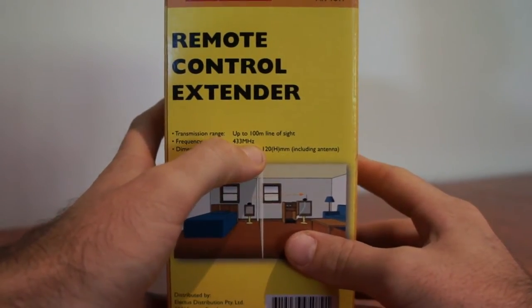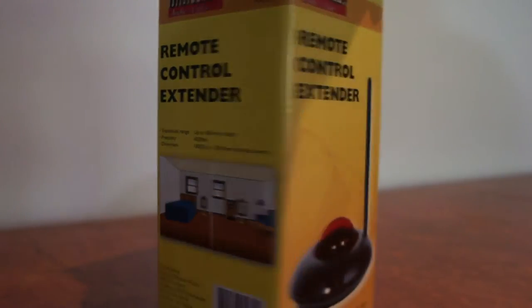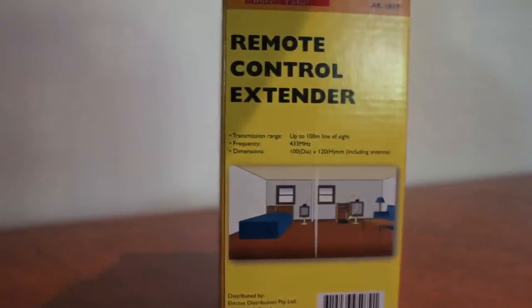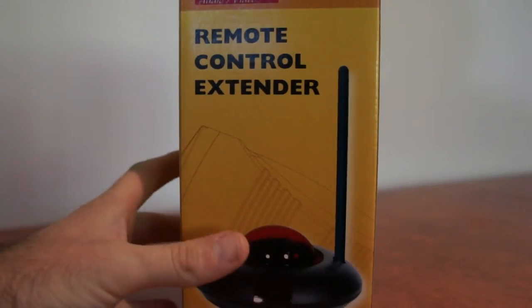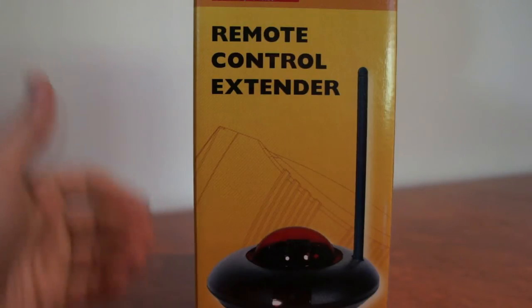Now the way things work with cordless telephones and all our wireless internet and wireless devices these days, they are on a frequency of about 2.4 GHz, and even now there are more and more frequency devices coming out on 5.8. So they are competing with one another and they get a lot of interference. This guy, however, being on 433 MHz is not competing with any other wireless devices. So that is why we guarantee this guy will work every single time.